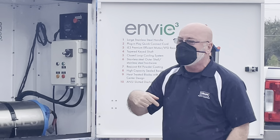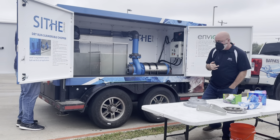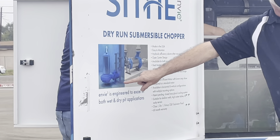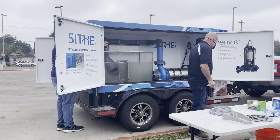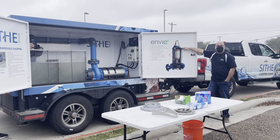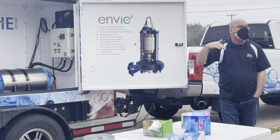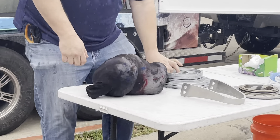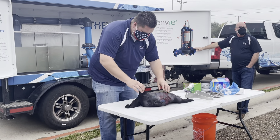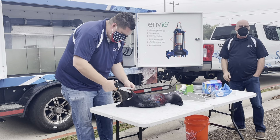This particular pump is our Envy-style chopper pump. It can be totally submerged or run totally dry. You can run it in a dry pit — hard piped — or in a submersible application fully submerged. Typically with a submersible pump, you set your floats to stop here so it doesn't overheat. But with this one, you can run the level down right to the pump, let it start cleaning out that lift station, and have less need for vac trucks coming out.